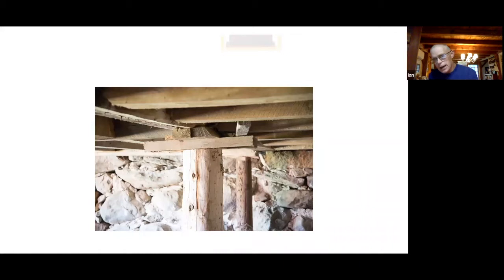This is the floor in that barn. You can see two new joists, some redone posting, and blocking on top of the post. When a bank barn has had moisture in the basement for a long period, you're going to get issues above from dry rot and powder post beetle, but mostly from cows having been in the barn at one time — which rots the floor above.